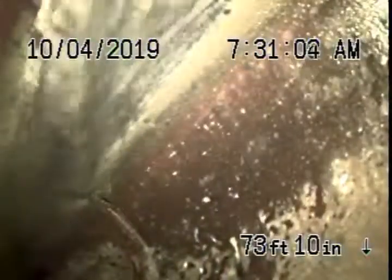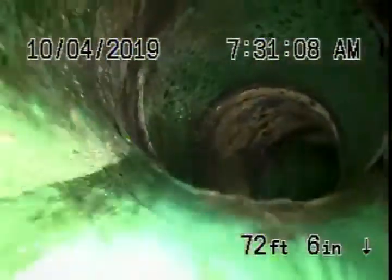So we've got to pull the camera back. It looks like we have a short section of SDR 35 plastic pipe, which comes back to some clay piping — six-inch clay pipe. This all looks very good, nice and clear. There's no roots or anything getting into the pipe.